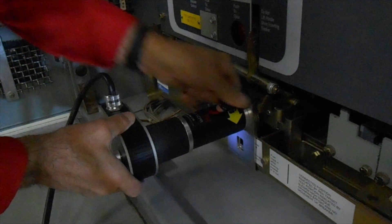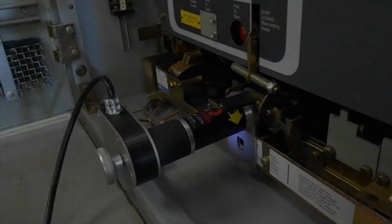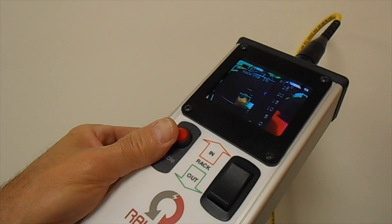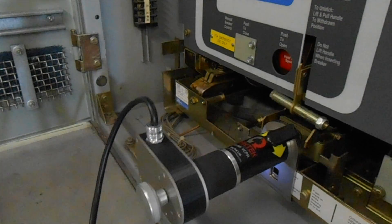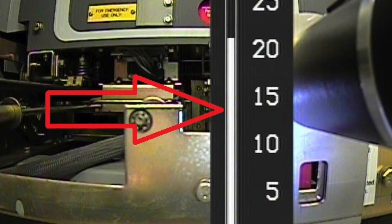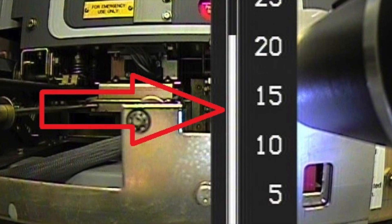Installing the VCPR is quick and straightforward. The racking motor is controlled from the handheld video display, with the operator positioned up to 50 feet away. The video screen displays a bar graph which indicates the amount of torque being applied to the racking mechanism.